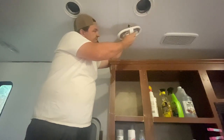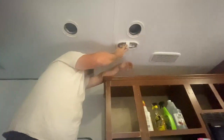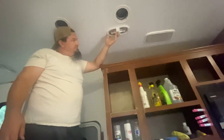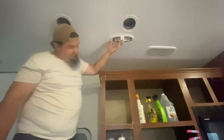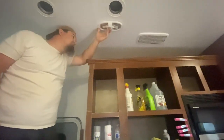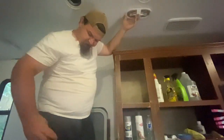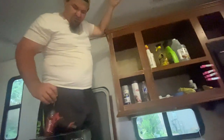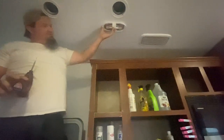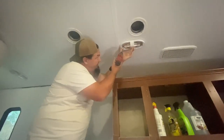The real question is, do I want to orient this with the rest of the lights in here, or do I want to make it go like this? This is right here in front of all these cabinets and the air duct. I think I kind of like it like this. I think I kind of like it like that. Also this is a preferential thing for you all — I'll make sure my wire nuts are actually inside the fixture itself and not inside the ceiling, because A, I feel like it's a little bit safer, and B, if I need to work on it, I don't have to go pull wires from the ceiling. I can just use what's there.